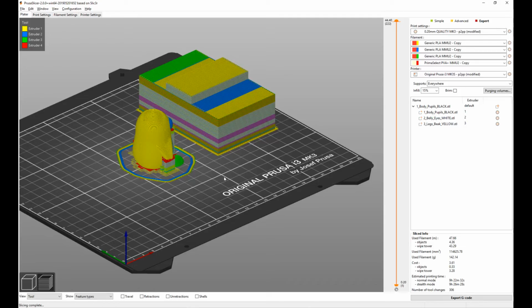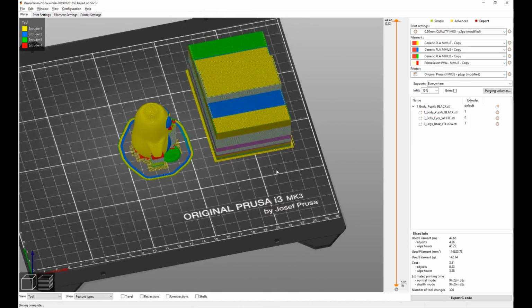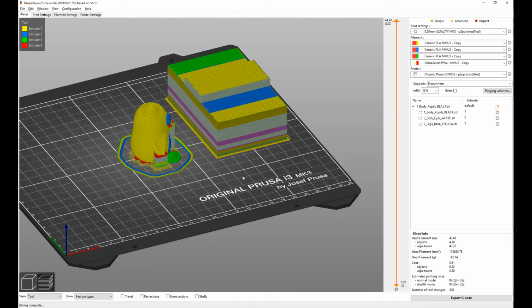And there was no way for me to make it work because the first layer is usually extruding a little bit less than the rest of the layers because the nozzle is squished toward the build plate. So it didn't spend enough PLA before it got to the transition. So when it was going to transition for the first time, it would just fill the whole transition block with PLA and then continue using PLA for the first interface layer. So then I tried P2PP, and since that one is generating pings independent of the transitions, it would have enough pings up towards the first transition that the actual transition was perfectly positioned and the print succeeded first try. So unless you run into problems with the pre-planning buffer or the motion planning buffer that I talked about earlier, there is no drawback with this way of doing the pings, and the benefits for me have been great.